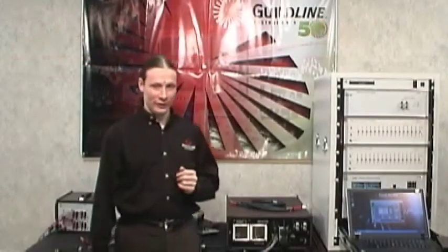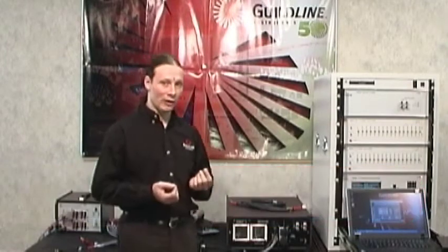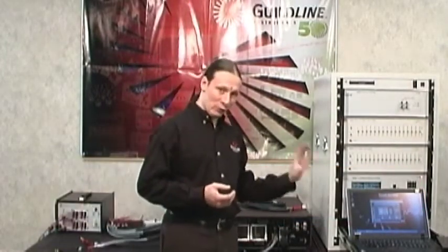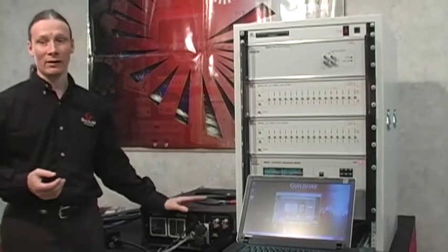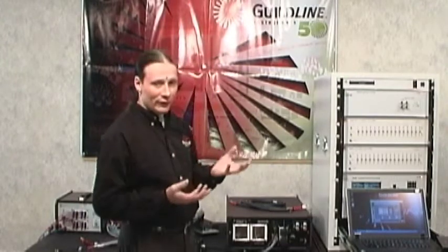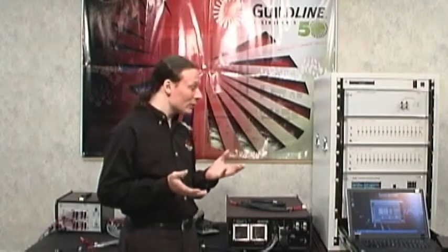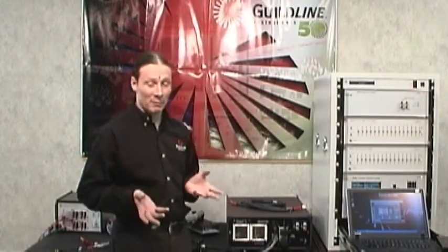The Quick Check utility is a very simple system checkout tool that's supplied in the Bridgeworks software. This plugin essentially runs the bridge in voltage mode, in current mode, and in low ohms mode with the high current range extender for a couple quick checks, quick measurements, and just make sure everything is working correctly essentially. It's a really fast process, takes about maybe half an hour, an hour at most, and it just runs through and basically checks all the system's capabilities.